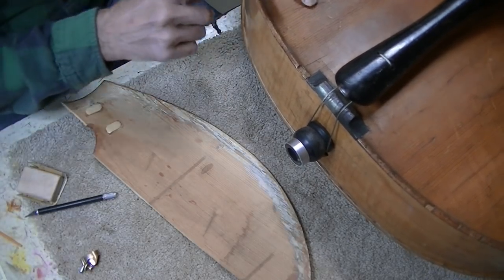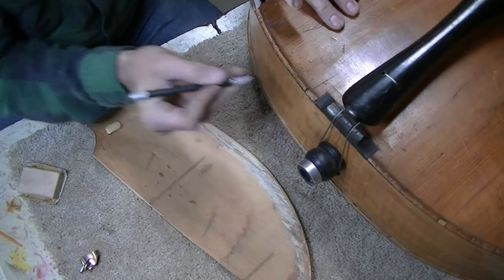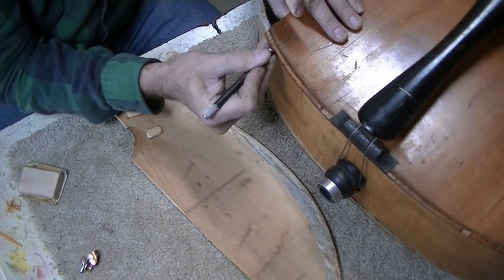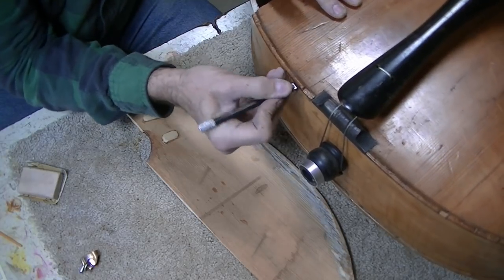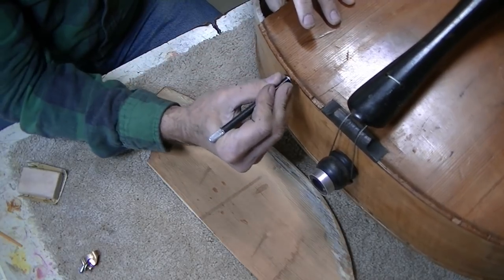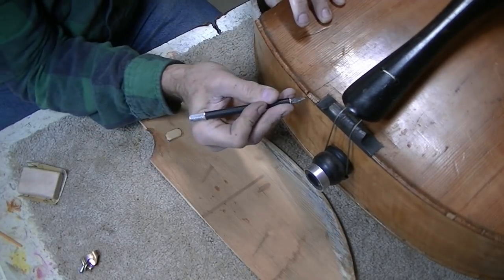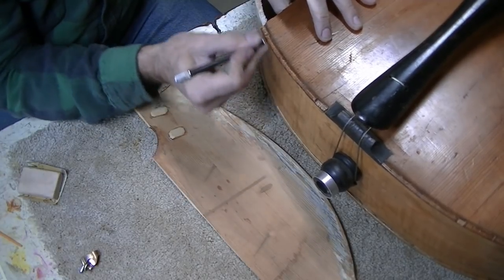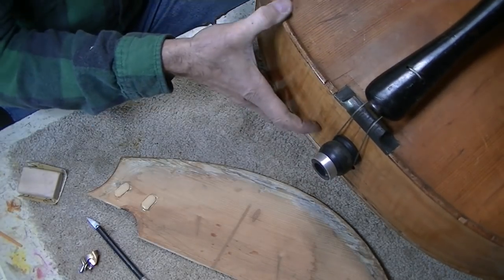Start here. I've got to get glue under here. And I'm going to clean this out with this. I can see the crack goes way back in there. I'm just going to take the back edge of this and knock it down on both surfaces, rubbing against the top, rubbing against the sides, so that we can clean off any lumps or any junk, clean it as we can get it. Titebond obviously bonds better to wood than it does to all this other junk, but it'll bond to the other junk too. I'm going to get me some clamps and get ready to clamp this down.